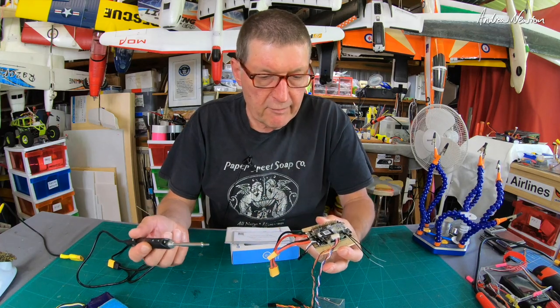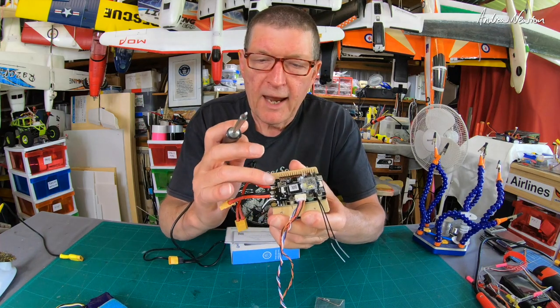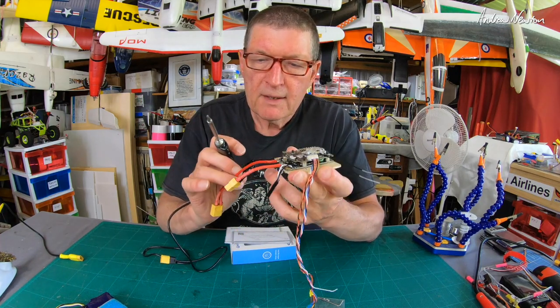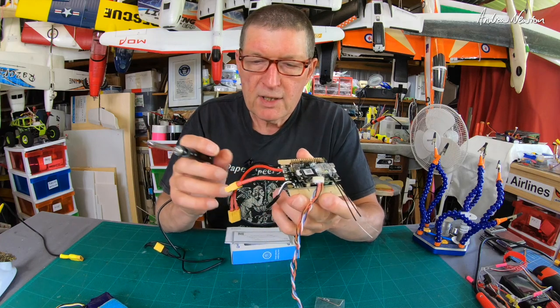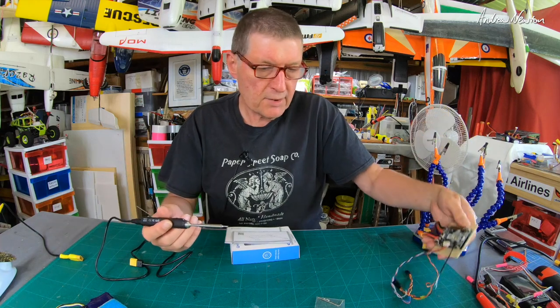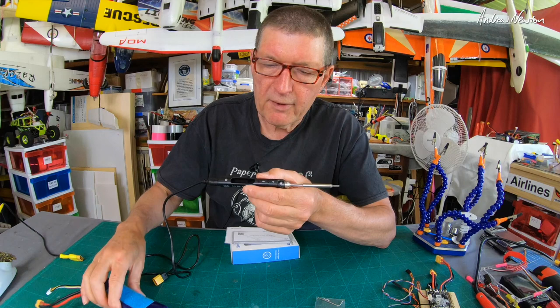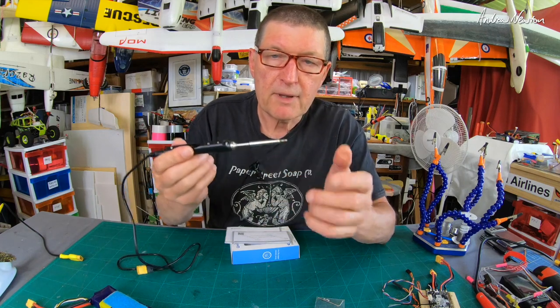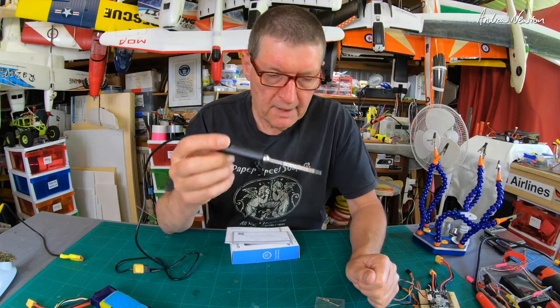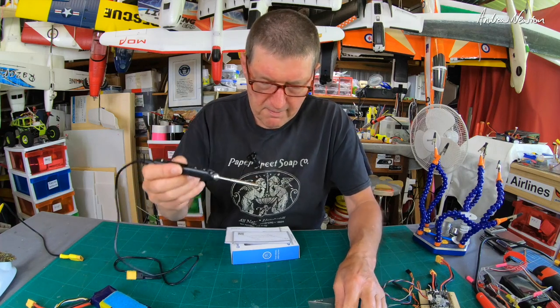but everyone who had them told me that no, they work perfectly well on hefty soldering for, like, you know, 12 gauge, 14 gauge power cables, and it's absolutely true too. These things will just suck as much current as they need from the battery to keep the correct temperature on the tip. Great stuff for such a little portable soldering iron.